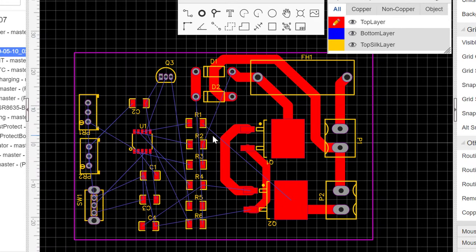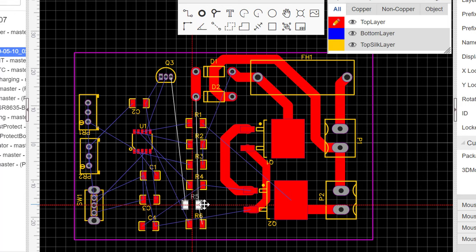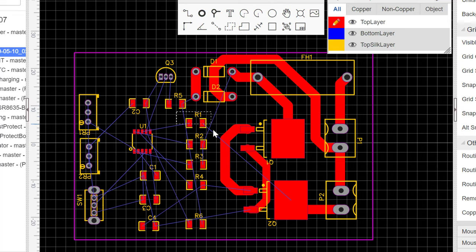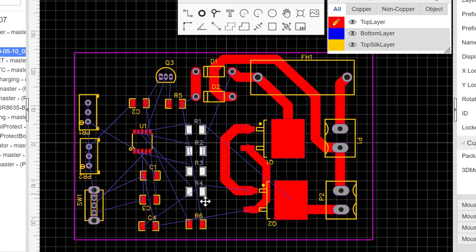Let's go ahead to the smaller component, and here you notice something. This transistor here has a connection that goes all the way around the PCB to this end, so you can see its wire is very far. So you have to bring this component closer so that the wiring is not so long, and that would also prevent any energy losses along the line. So let's go ahead and leave this here and then restructure the rest. So we'll move these guys down,